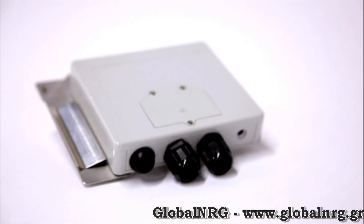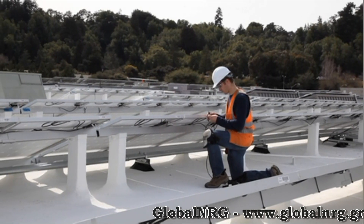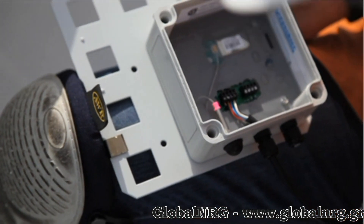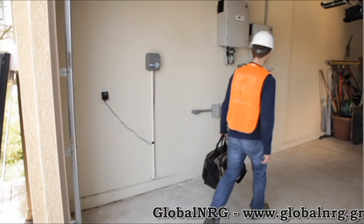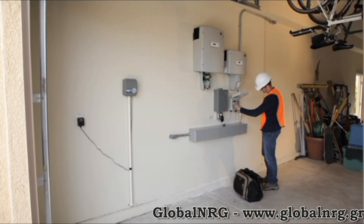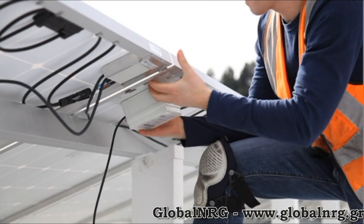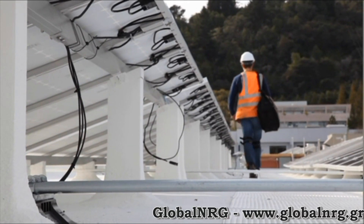The gateway is the antenna for the management unit to communicate wirelessly with the maximizers. Therefore, it should be placed in the center of the array. The gateway is connected to the management unit via a standard RS-485 cable. Simply run the wires through the gland at the bottom of the gateway and connect them to the bulkhead connector on the circuit board. If the MMU is already powered on, you can verify the gateway connection by checking the LED light on the gateway. The RS-485 cable run back to the MMU can easily be done at the same time you are running the power lines back to the inverter. Make sure to keep the same wire color configuration when you connect the other end of the cable to the management unit. The gateway is typically mounted on the back of a solar module on the upper left side — it clips right into the module frame. Make sure to mount it with the connections facing down to prevent moisture from entering. If you have multiple gateways, they are connected in series along the RS-485 cable, and only the last gateway in the run should have the termination resistor.